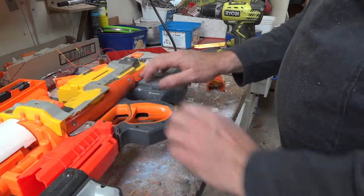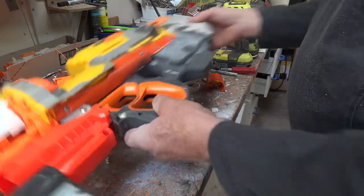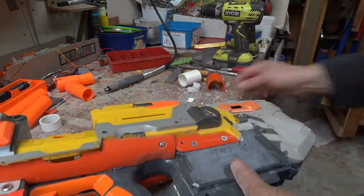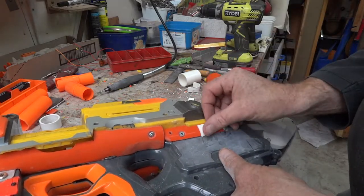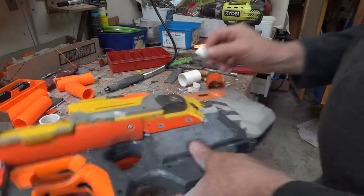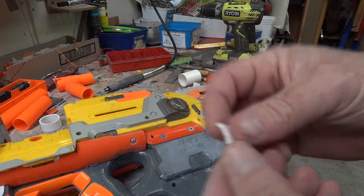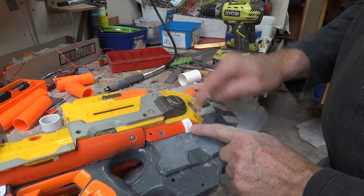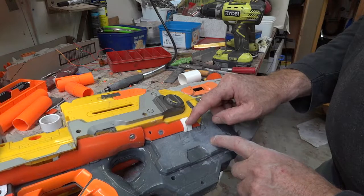Unfortunately I couldn't get any with smaller heads, and I've countersunk the plastic as much as I can and still have the screw there. So what I'm going to do — I've got little bits of plastic, another pipe — I'm just going to cut pieces at the right length and put them over. I have to Dremel out the inside of them, as you can see there, so it fits over. Just a little bit of tape and a little bit of the normal blue pipe glue will hold it in place.